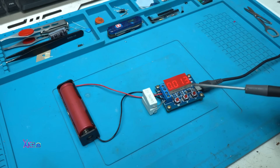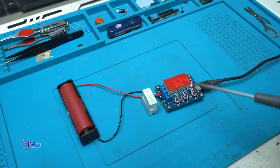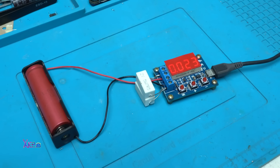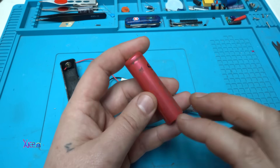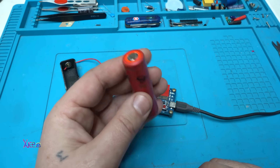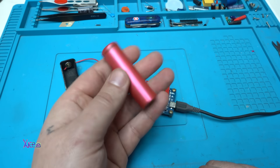870 milliamperes is pulling. The voltage of the battery is 3.24 volts, and ampere-hours: 15. You can see right now the LEDs are blinking — the process is finished. It says how many milliampere-hours, and that is very low. This battery is bad. So you can test your lithium batteries for capacity and see if they are good or bad — this one is bad.